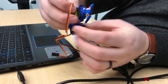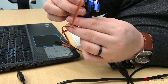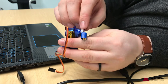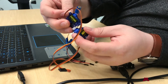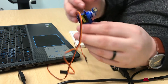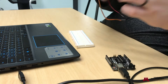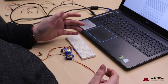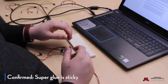We want to control the laser in two ways: side to side, and up and down. In technical terms those are called yaw (Y-A-W) and pitch (P-I-T-C-H), so we need one servo for each. I've got the servo horn of the yaw servo glued to the pitch servo. I used standard super glue, which held really well. One thing to be careful of: don't block the screw hole. And definitely get an adult's help — it's easy to super glue yourself to things.